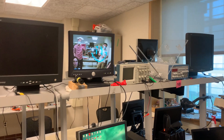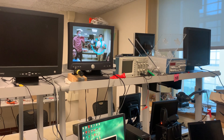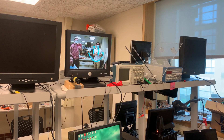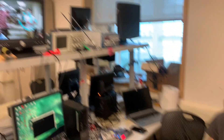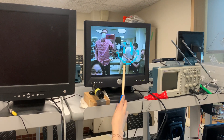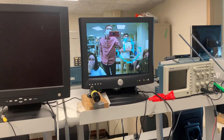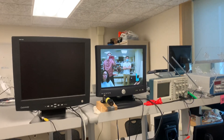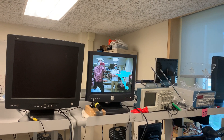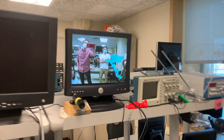The video processing is taking place on the FPGA — color detection. The FPGA is driving the VGA screen based off an HPS buffer and then the video-in buffer, which comes from the FPGA. There's a transparency feature where you can still see behind the pixels — the video behind it. The FPGA is producing, to the VGA, a combination of the video pixel it sees and the pixel it draws, which can be switched to be non-transparent. You're toggling between transparent and non-transparent with a switch.